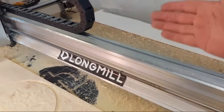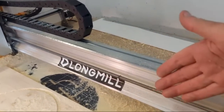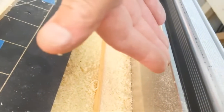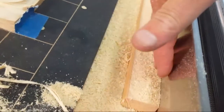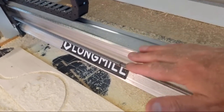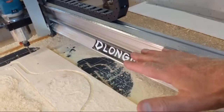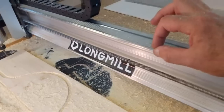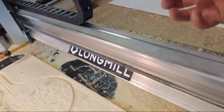So they have these theoretical planes that go through surfaces. You've got steel here, right? There's a theoretical plane that goes through there. There's another theoretical plane that goes down this way. Another theoretical plane. So this extrusion has been all redesigned. It's got so many different planes in it. Every time you add a plane, it's like adding another wall. And every point that those planes intersect, not just inside the material, but in the space, adds rigidity.